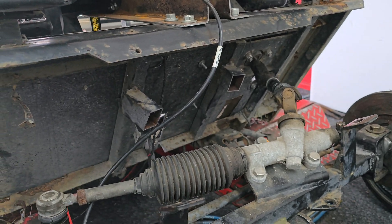Another small job is making up a little bracket to secure these. Found a bit of square stock here, so we'll drill a hole and make a little billet bracket — old school, got to think outside the square. There's our little clamp all done, pretty happy with how it turned out. Probably one of my favourite parts of the cart now because it's so simple yet there's a lot of detail. Looks like it's been done on the CNC but it's all been done by hand with basic hand tools. We've machined this little spacer with an M6 thread going through, so that way we can clamp down on it and attach it to the valve cover through the back side.